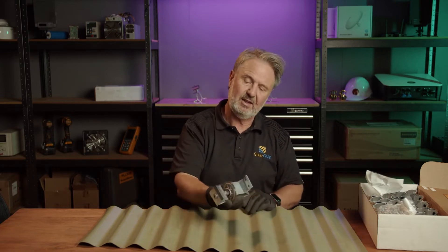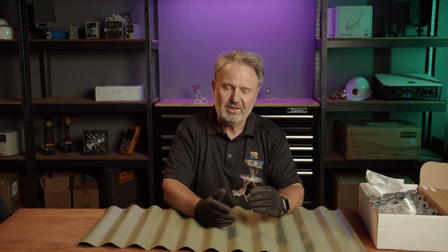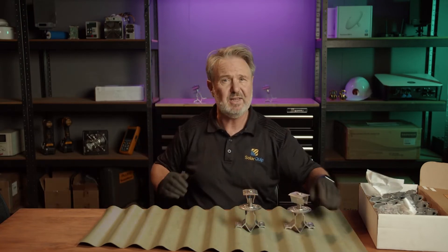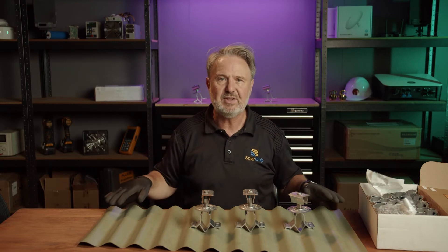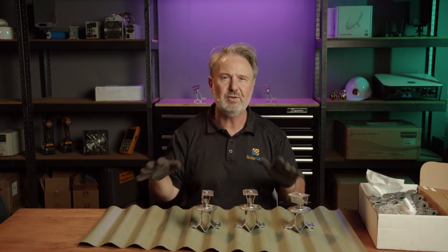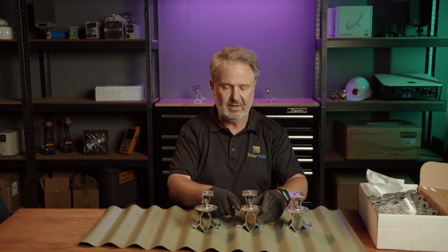That's the corrugated iron solution from S5. There are some things I really like about this product. For a start there's no rails — no cutting of rails, no carrying of rails. And from an environmental perspective there's no embodied energy of that extra aluminium. Really the rails are most of the embodied energy in a mounting system because of all the aluminium and the high intensity energy required to make them. This design with just mid and end clamps means you can very easily orientate your panels in either landscape or portrait. I don't have to pick up a rafter — I'm attaching directly to the corrugated iron, giving immense flexibility about where the modules are laid out. No more worrying that the screw lines are in the wrong place. So that's the end clamp, mid clamp, mid clamp and the integrated earth bond.